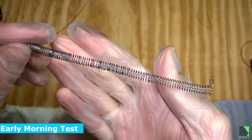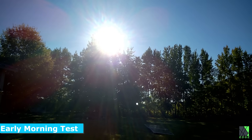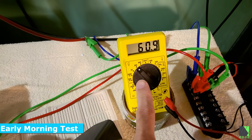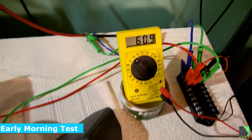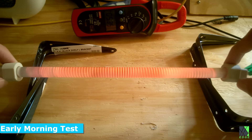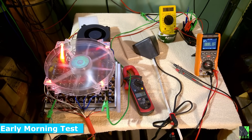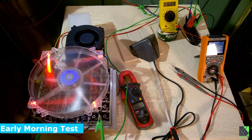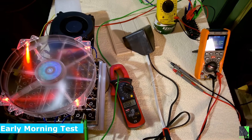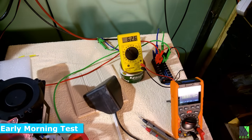In other words, unlike a piece of bare nichrome wire, this diode chain is able to regulate itself even in early morning or late evening conditions, and keep the voltage of the solar panel array up around the optimum voltage range, which is also called the max power voltage. A diode chain or diode string easily outperforms a directly connected nichrome heating element, which has a static resistance and cannot regulate itself. There is no smart circuitry, no MPPT circuit, no DC conversion. In the mornings and evenings, I use the diode string to capture whatever heat is available, because a nichrome heater would just pull the solar panels down to basically a dead short — only a few volts and I'd get almost no heat.